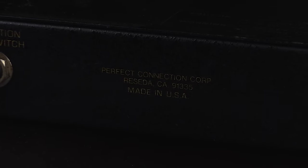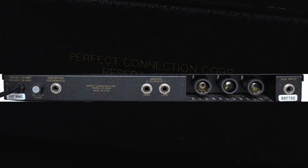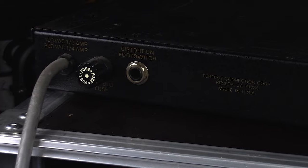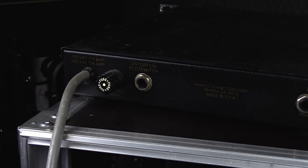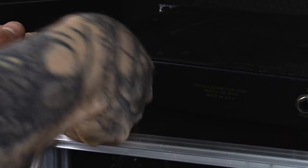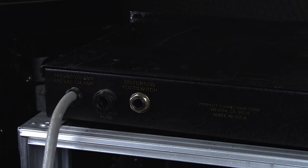Then there's the so-called True 88 model, which is, well, kinda misleading, because the Marshall mod started already in the mid and late 87 models, which all had no DI out and differing wiring, capacitors and electronic arrangements. If I recall correctly, they even had different transformers. I might be wrong on that and I would have to check that up completely and find more pictures and videos of open GP-1000s to confirm this, but I can't.